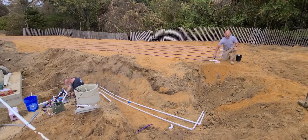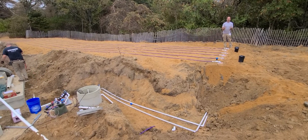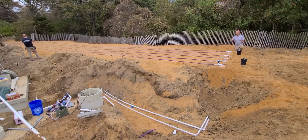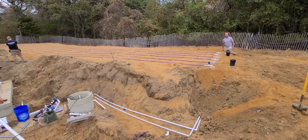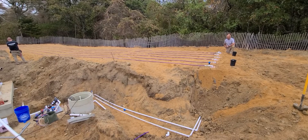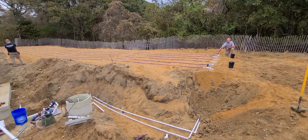When the pump is energized again, it's going to fill up the tubing and we're going to flush out the return side. The clean water is entering the manifold through the supply side, filling up all the tubing, looping around, coming back. Eventually it's going to come out and bleed out this open return manifold. The pressure will be diminished due to friction loss through the tubing, so the strength of the spout on the return will be a lot less than the supply side. There's also a lot of air burping out of the line. Once this air valve is secured, we have a closed system and we'll be able to check our flow rate.